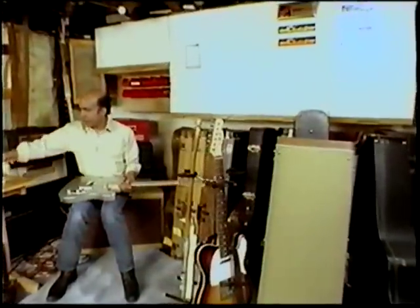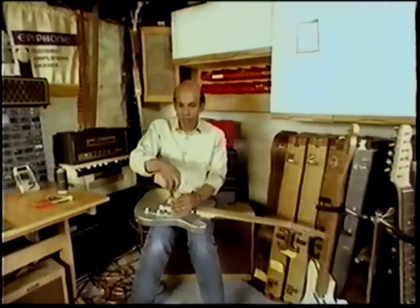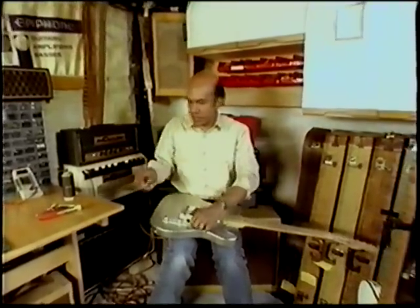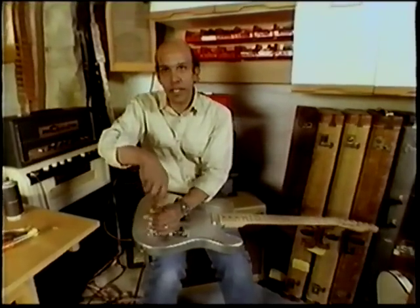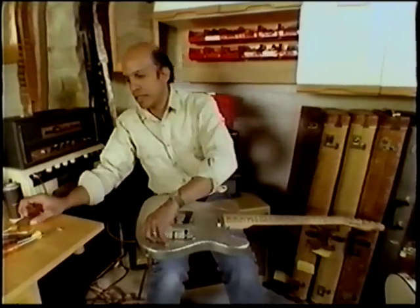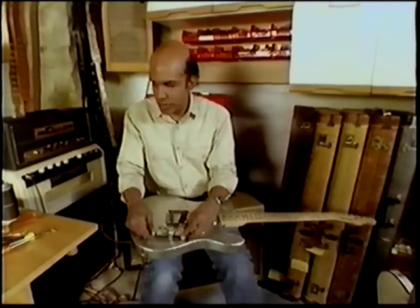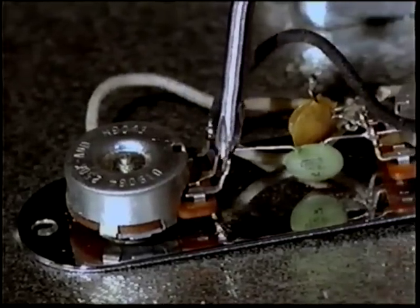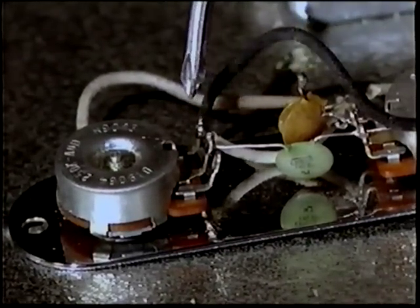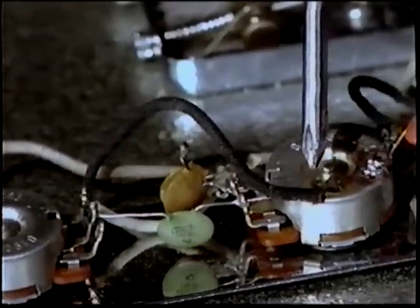Back from the dressing room, and my guy tells me his guitar is making funny noises. So let's see what's happening inside, have a visual inspection. We shall find something in here. If we don't, we know that it has to be inside the guitar cord, or perhaps the amplifier itself. We'll look around, make sure that all the soldering joints are nice and tight and shiny. Nothing is loose, there are no pieces of wire in between the connections.